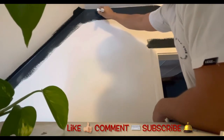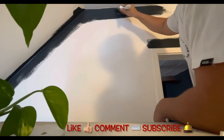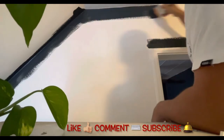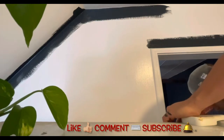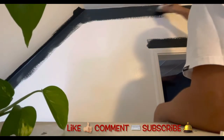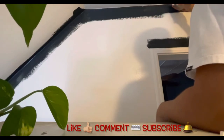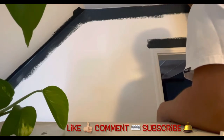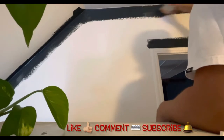For that sharp straight line, you got to put that tape. And where it meets the tape and the wall, you got to put a little bit of caulking on the seam. Then paint it. Then remove the tape and you're gonna have that sharp straight line. I will show it right now.